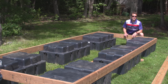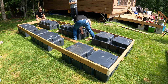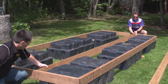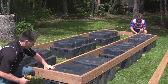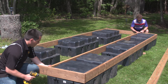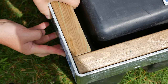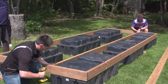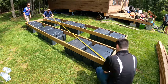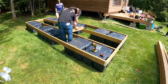Assembling with deck screws makes it really easy to square, and once you've got it square and the middle floats in the center of the platform, it's time to put the joists in place. The joists help guide the position and trap the floats where they're going to be. There is hardware to hold the floats in place, but the floats are trapped with still enough room to manage the hardware later on. Keep checking the frame is square as you add each stringer before bolting on any of the steel hardware.